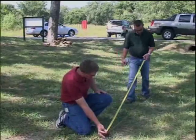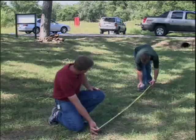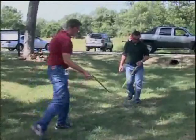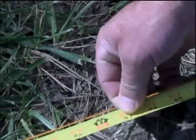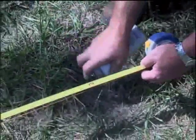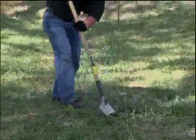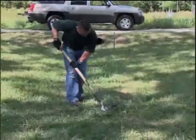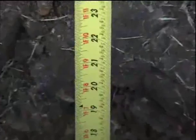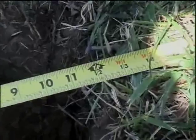When laying out your fence line, measure 96 and 3/4 inches from center of post to center of post at grade. This will ensure your post width will accommodate your panel. Marking your post centers with paint or a stake is the simplest way to ensure your hole's location. Depending on the area you are located in, the footing size may vary to accommodate your climate. Ameristar recommends a 21-inch footing depth and a minimum diameter of 8 inches for a typical installation.